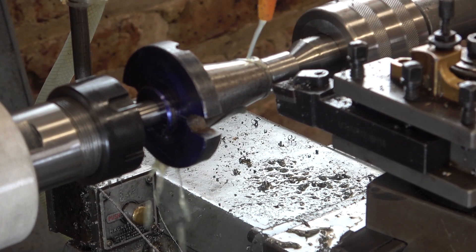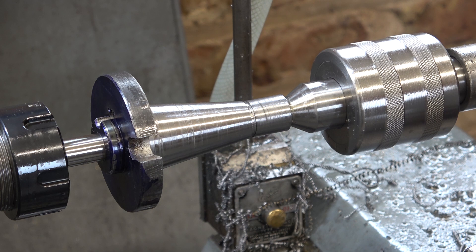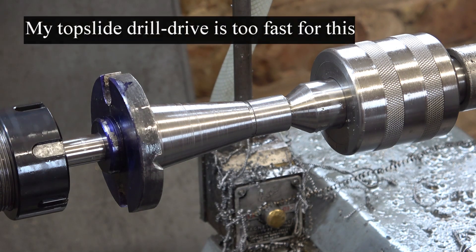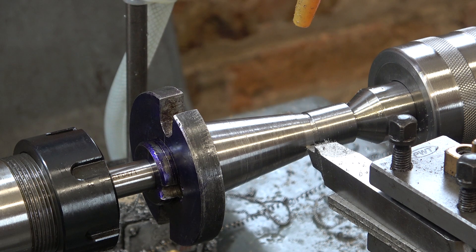It's taper time. There's about 2mm to come off, so 1mm on the dial. It's done. I wish it was a better finish — it's about usual for when I cut tapers. It's very difficult to move the top slide smoothly and get an even cut. Getting a good finish is proving extremely difficult — I tried with carbide, using all the tricks, and still end up with a rippled finish. So I'm using high-speed steel with a rounded nose, a very light cut, running at quite high speed — 700 rpm — and a very gradual turn on the top slide handle. I seem to be making progress now.